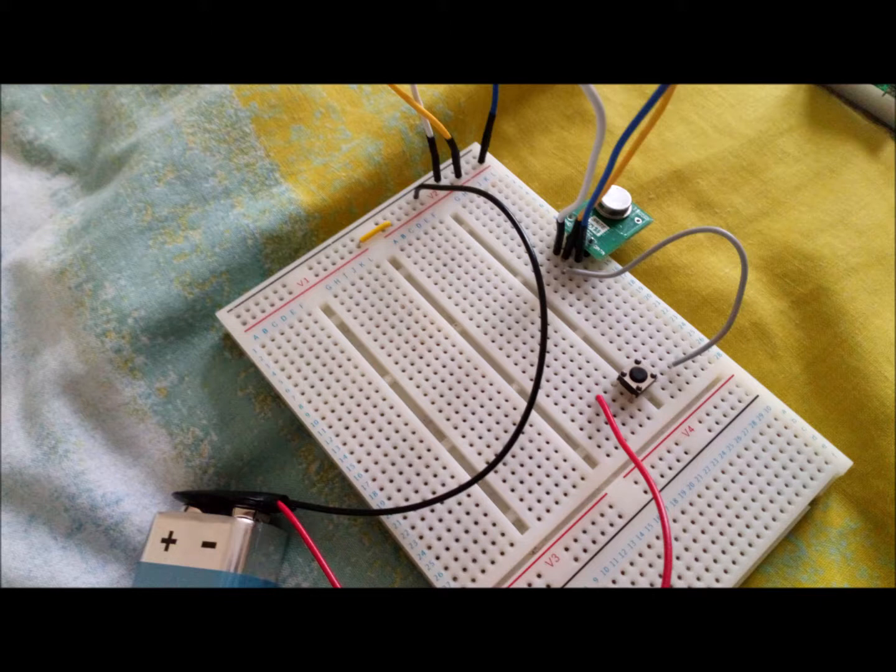In this image we can see the transmitter breadboard has been set up. There is a white wire that is connected to the horizontal bar that is also connected to the GND or ground prong of the transmitter. This white wire is then connected to one of the top holes of the breadboard. See that black thin line? That is the negative strip. It reaches all the way along the length of the breadboard from left to right, and the white wire is connected to it.